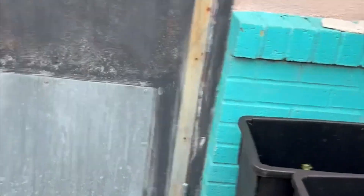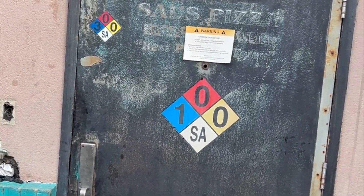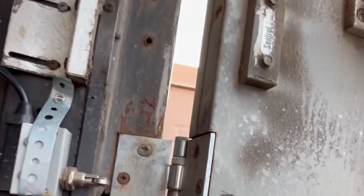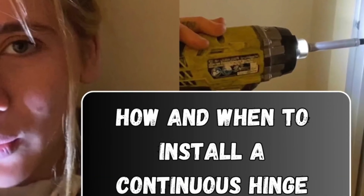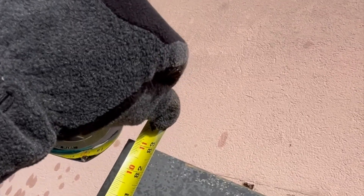This metal door is 83 inches tall and 43 and three-quarters inches wide. How would you replace this — would you even know where to start? This thing is completely trash, as you can see. With metal doors they come in standard sizes, but you need to match the hinge locations. These hinges look crappy and not secure, so I'm going to use a continuous hinge. Measuring: it's 43 and three-quarters inches wide, meaning it's a 44-inch door, and 83 inches tall — called a seven-foot door.